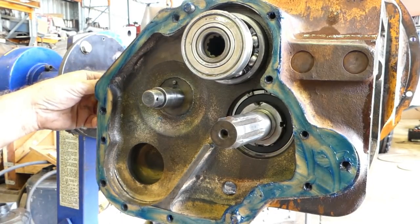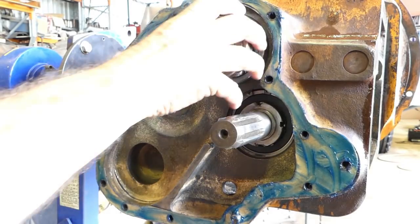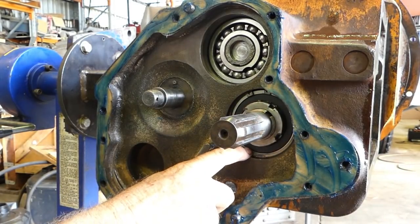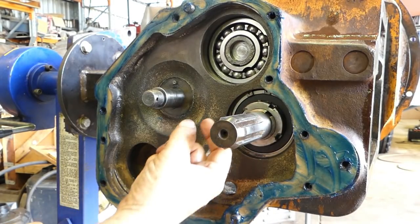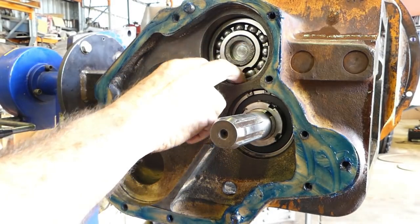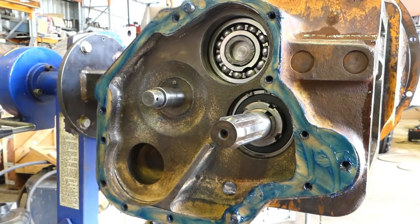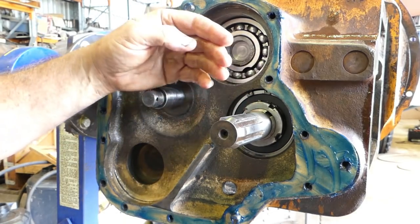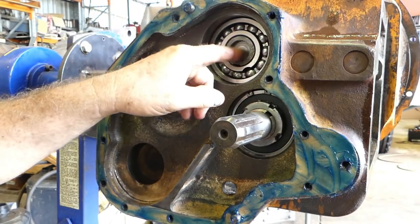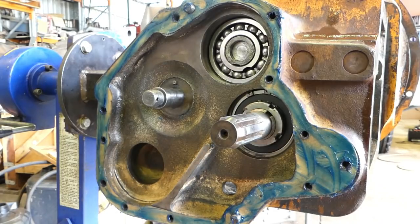We've tightened up the shaft here, which we will wire on. So this shaft here, this is where we had the circlip at the front and the back of this bearing. That stops that from moving, and it's just supported at the front. But this hollow drive shaft, your main drive shaft, it has to make sure that there's no movement there. Now, we push that forward when we put the front housing on, so we know that's sitting up in the front housing. So we keep that there.